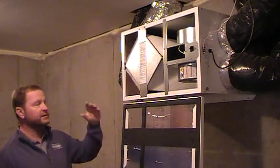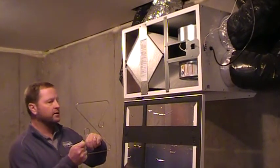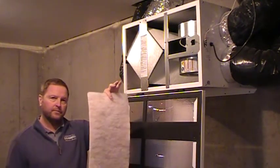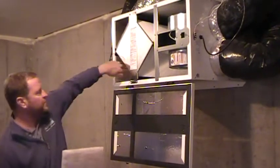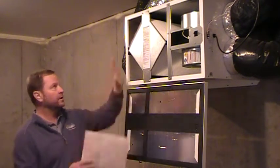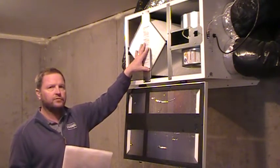Maintaining it is as easy as using a vacuum — that's really all you need to do. I'm going to reach in here and pull out this little hanger. This hanger is a compression hanger that I can push up and down, which will expand and retract. In some air exchangers there will be two on the bottom and two on the top. You'll pull out this filter and vacuum it — vacuum both sides, along with vacuuming the top one. In smaller homes or townhomes, there's only one set and the filter is smaller. Once you're done vacuuming this one, pull out the second one and vacuum it also. Then vacuum all around this core. If it's not dirty in the winter, you shouldn't have to do it, but if it's dirty in the summer, definitely do it.